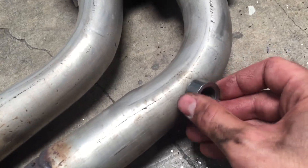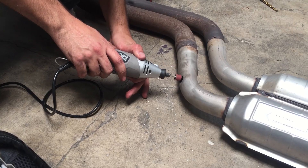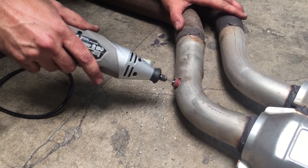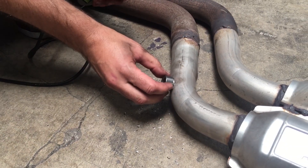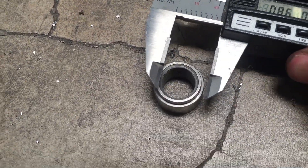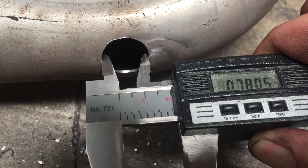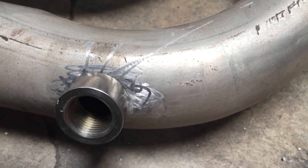This stepper bit was not big enough so we need to basically widen this hole up. Tyler and I are going to use this Dremel bit here. I got some calipers — 0.875 inches is the diameter we need. We're at 0.780 right now, so we're almost there. Alright, we are live streaming right now. So this is ready — ready for a little tack weld session.